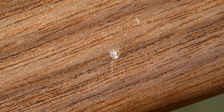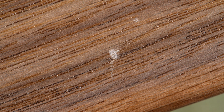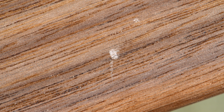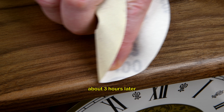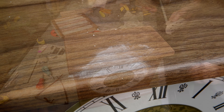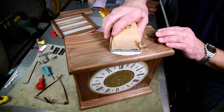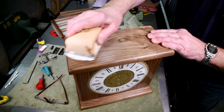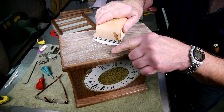Do unto others — if I can hear their dogs barking, I'm sure they can hear all my noisy equipment. Now, that being said, I like dogs. However, they might not like woodworking. I'm just going to rough the entire surface here with 600 grit so that the wipe-on poly will adhere to it better. I still see a little indentation there but I think I won't see it once I get the poly on.